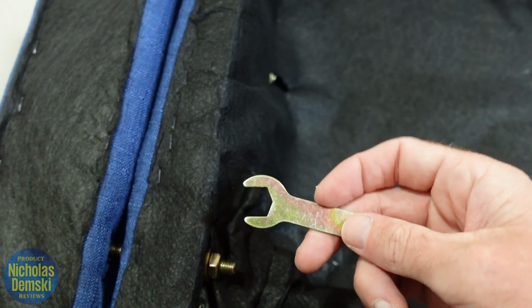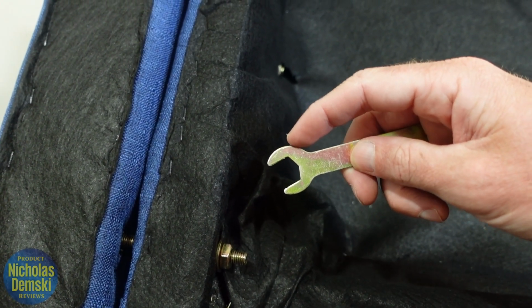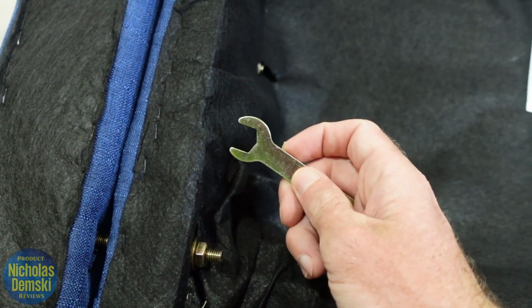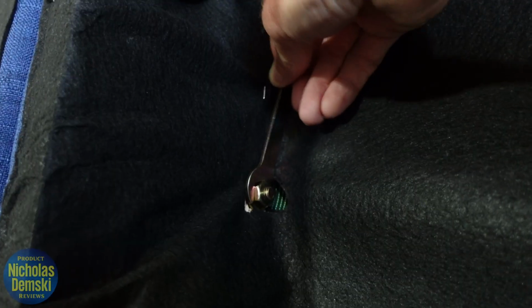And if you haven't used a wrench like this before, you'll see that there's a thicker side and a thinner side here. You always want to push in the direction of this. So if we're going to be rotating right, I'm putting this on top and pushing down like that because the strength of the wrench is in the thick side. So you'll see the gaps now as I'm continuing to tighten them, and you'll watch them disappear.